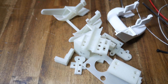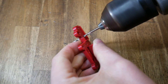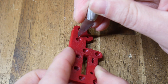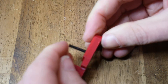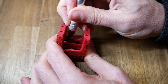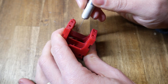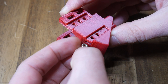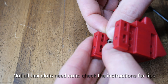Soon you'll have all your parts ready for post-processing. It's a good idea to use a drill to clean up any of the holes. The holes on the adapter plates are designed to not need support, but you still might need to clean them up a little. The aim is to have M3 hardware go in far enough to sit flush so the entire surface is flat. You might also have some obvious defects to cut away with a blade — we're aiming to have the airflow as smooth as possible. The fiddliest part is inserting the M3 nuts that go through the assembly to hold everything together.